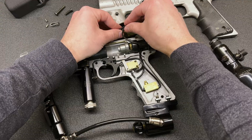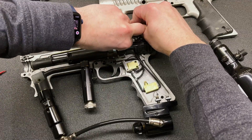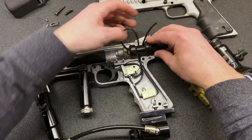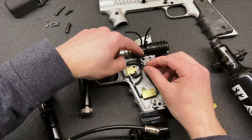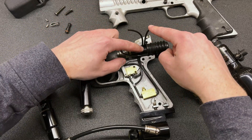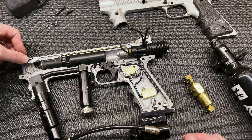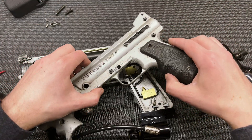To put this back together I need to pull these hoses. For space reasons I'm using little barb fittings here — I would like to use push-connect fittings because I can actually get those apart without destroying things, but for now this is what we have. The one coming up from the bottom is our RAM line, the one to the front is the switched air supply, and this one here is the restricted airflow. Everything is in place, lines are where I want them, switch is in — don't forget the safety and the little sight piece in there.